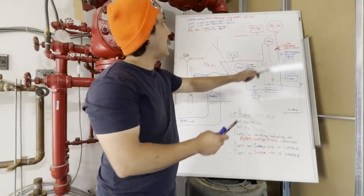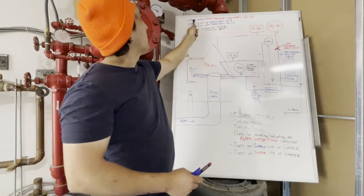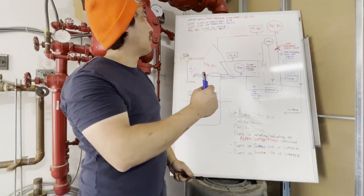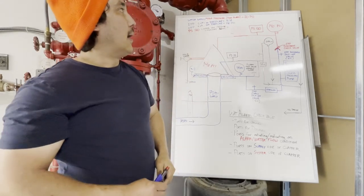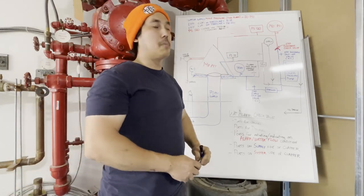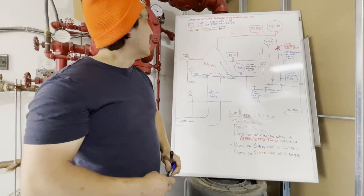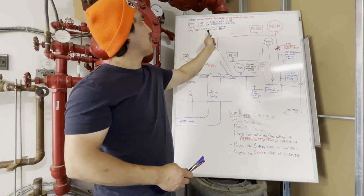So the excess pressure pump cut-in pressure is N/A for this manual system — there is no cut-in, you come in and turn it on whenever you want. The excess pressure pump cut-out pressure is 140 PSI. You could go as high as 175 maximum system pressure, but I don't recommend it — if we've got 70 PSI incoming, there's really no need to go all the way up. The one thing left blank is my PS120 low pressure supervisory signal level, which I can adjust — it is that red switch up there.